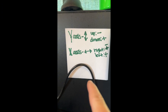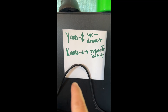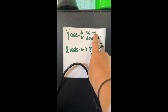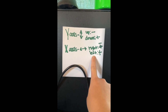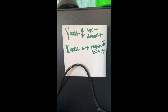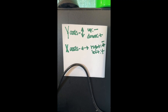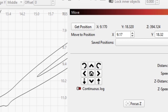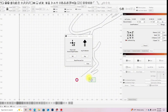Here's my move menu. When aligning your targets, line them up on your laser as close as you can, then go into the Move menu and push Get Position — that button shows you the coordinates. If you need to go up on the Y-axis, subtract a decimal; to go down, add a decimal. On the X-axis, to go right subtract it; to go left, add it. It's a bit finicky so pulse it a few times to see where it hits.